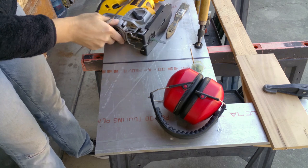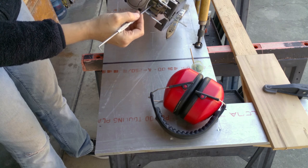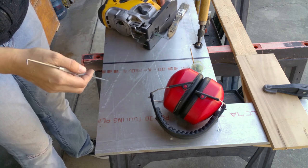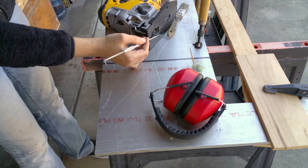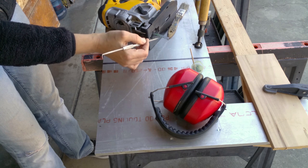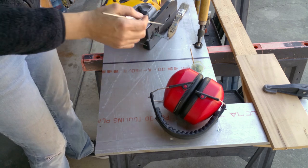I'm also putting grease on this little slide here to try to lengthen the tool life, because I am putting some pressure on this. I'm using a pick to pull the galled-in chips off the blade. You can feel when it stops cutting - it's usually a chip that's bonded in there. Otherwise it doesn't work bad and it seems to be giving me decent accuracy.